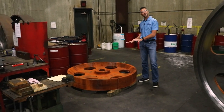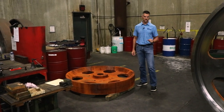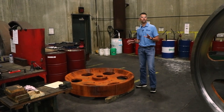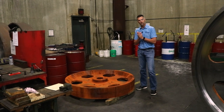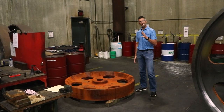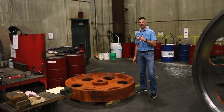What we're looking at right now is a rough casting, and this is cast iron — it's not a steel wheel. Cast iron is super important when it comes to a band mill. When you're running that steel saw blade on a steel wheel, it creates friction and heat, and that heat stays in that saw blade and causes that blade to lose tension a lot faster.